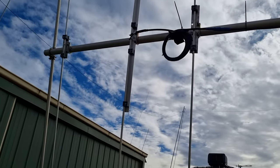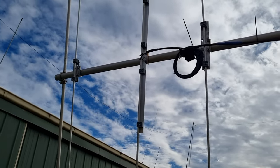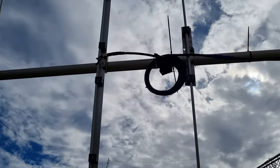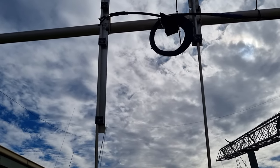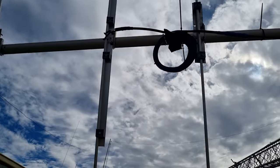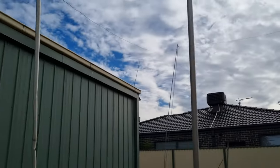So we've got the three elements there and the rest go through quite well - it works really well. Signal reports have been excellent, and that's the mounting system I'm using. Pretty simple on the feed point - it's basically a coax choke using hydraulic line clamps to hold everything in place. It's not rocket science, just get the spacings right.